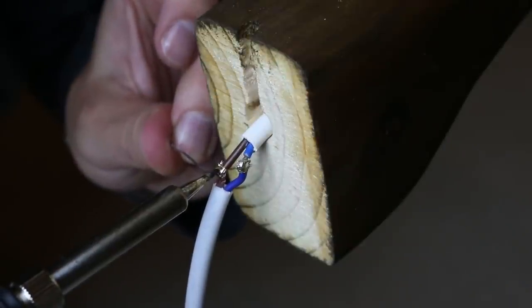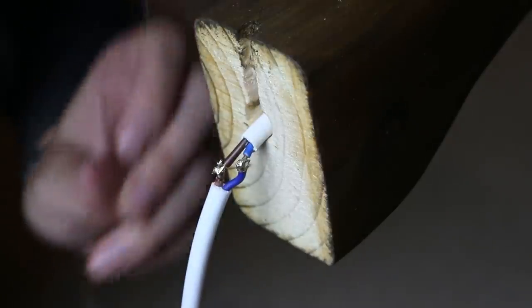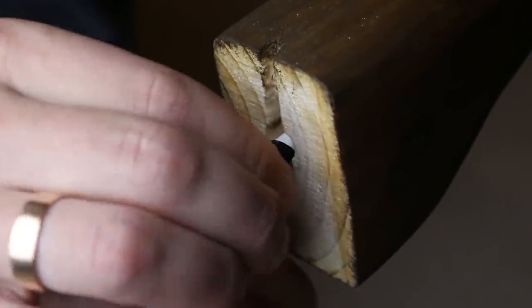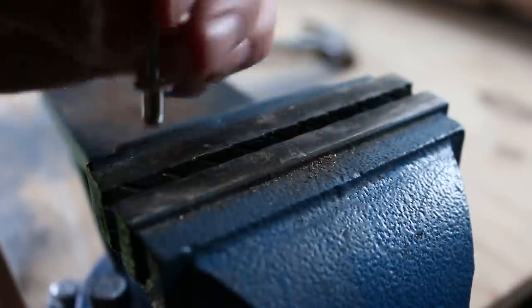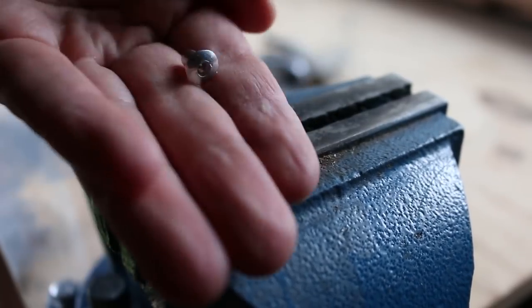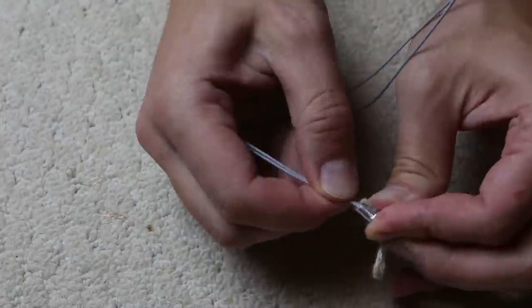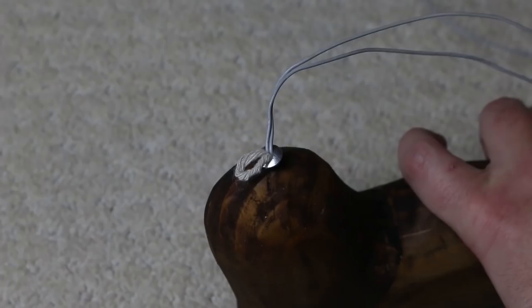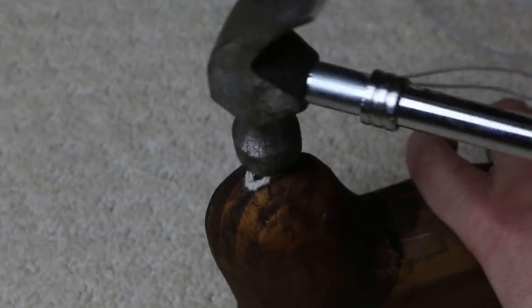The light's gonna be powered from the mains voltage, so I need to be absolutely sure that I don't have any shorts. For this reason, I wrap both individual wires and the entire cable in electrical tape. Good. Now I'm harvesting a rivet head, which will perfectly hide the hole in the lamp stand where the thin wire comes out. Just watch. As I said, perfectly.